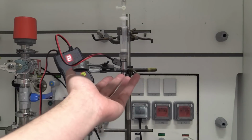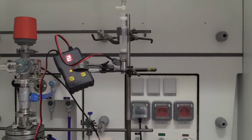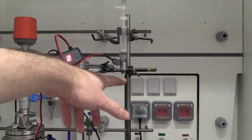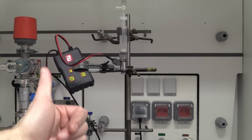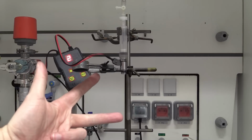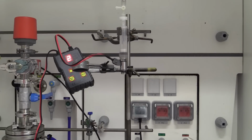This is leaking, I can hear it leaking. So this is the problem that I had last time, is with certain solvents it tends to leak more than others, and I'd never really figured out why. So it's a learning experience with these valves. So what I'm going to do first of all is get a high speed camera on this, and I'm just going to try with 3 solvents, with water, with ethanol, and with pentane, to get a rough idea of what these jets look like when they're coming out, for which we will need the high speed camera.